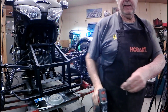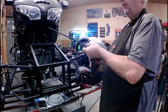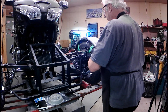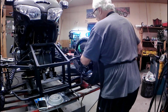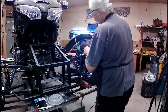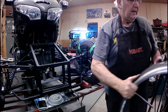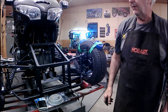To drill the holes I got this 1/4-inch by 12-inch bit, which I bought at of all places Harbor Freight. I thought it probably wouldn't be very good, but it turns out to be a really good drill bit. So this one's done — all I'm going to do is drill a little hole right here; it'll be a self-tapper that goes in there after it's all assembled. I'll wash the inside of this and the whole thing gets powder coated in here, so it's a little more rust resistant. I think that whole process took a little over an hour to build those two fenders, so they go really quick.